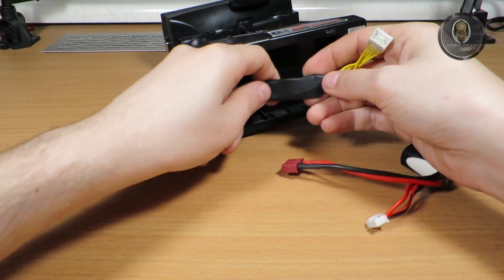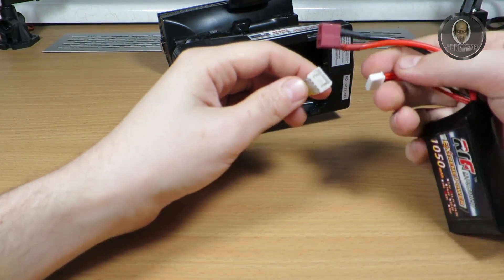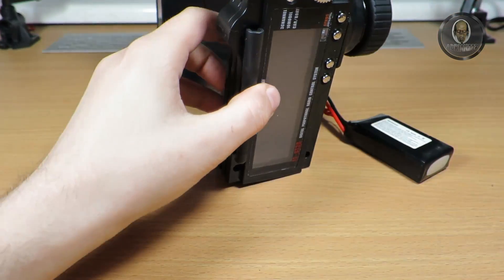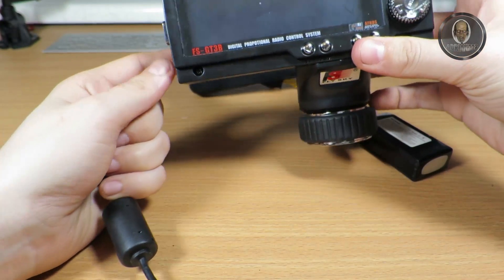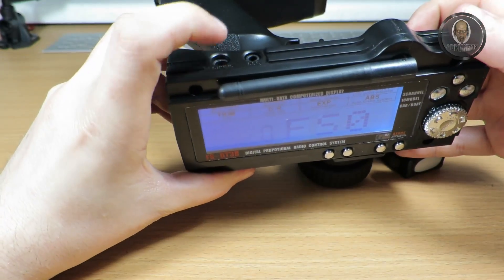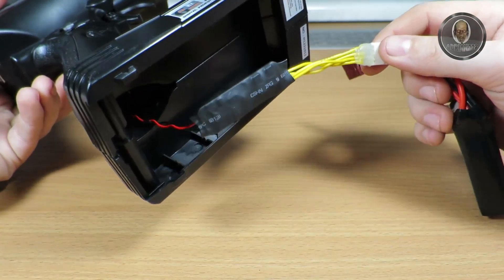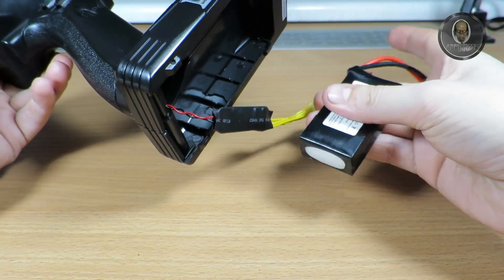Here is the ready circuit - as you can see it has heat shrink and hot glue. The hot glue holds the cables so you can't pull them out. The only downside with the circuit is that sometimes when first connected it will not turn on. As you can see I turn it on and it doesn't work. You just need to connect a power supply briefly to this port - with around 20 volts - to activate it.